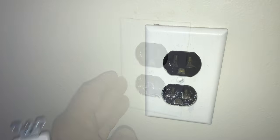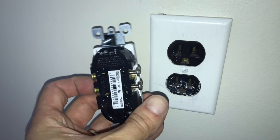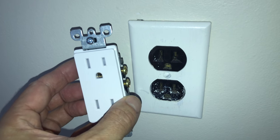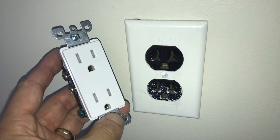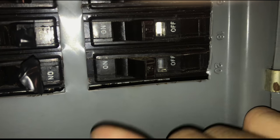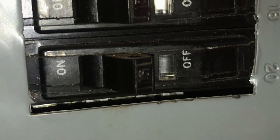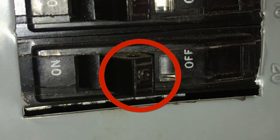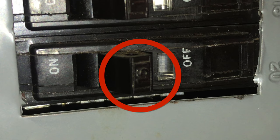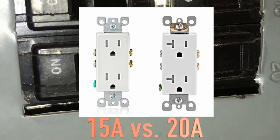Since the plugs are going to fall out really easily, in this video we want to replace this outlet with a new one. There are a lot of regulations on how to do this correctly and safely, so we really want to make sure we do this right. The first thing we do is take a look at our breaker box — for two reasons: we have to turn off the circuit so we don't get electrocuted, and we also want to find out what kind of circuit this is. In this case you can see the 15 on the breaker, so we are looking at a 15-amp circuit, which means I have to replace the old outlet with a new 15-amp outlet. We don't want to make the mistake of using a 20-amp outlet.